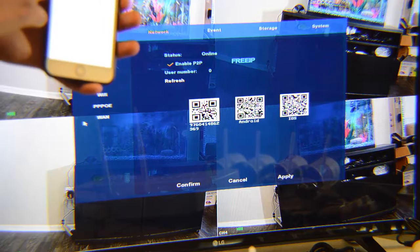Another thing to show you in the NVR setup: right-click on the menu, type the password 12345, click right, and go to main menu. To change the date and time, go to System in the last item of the main menu, click on the date setting, set it to 24-hour format, and choose your month, day, year and time, then click confirm.